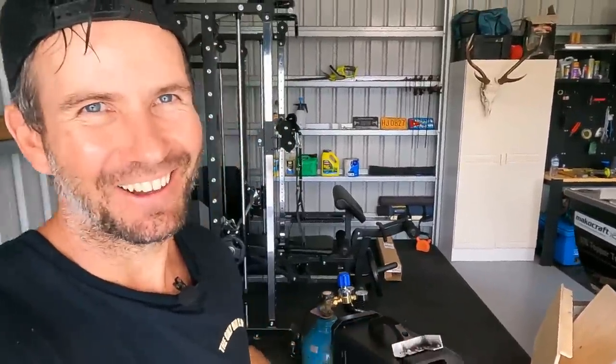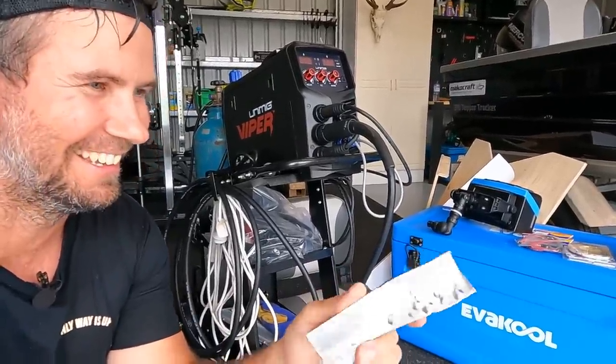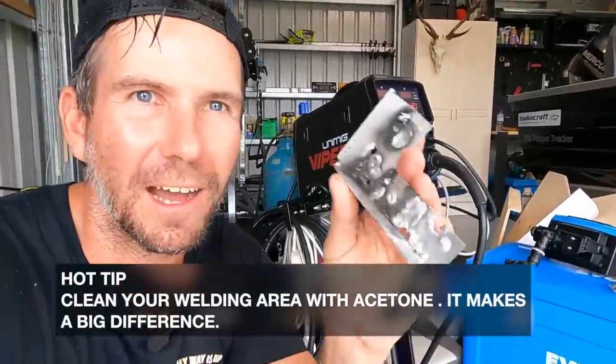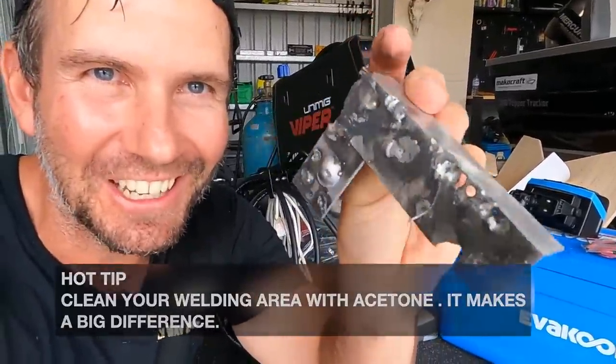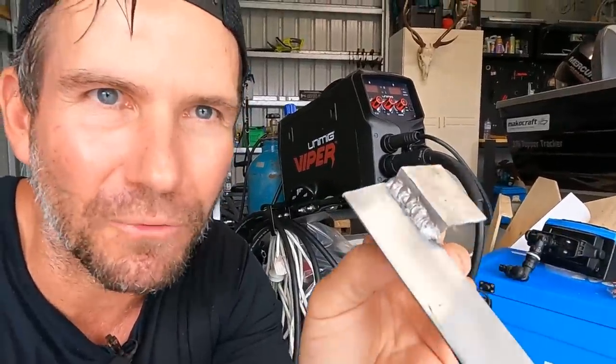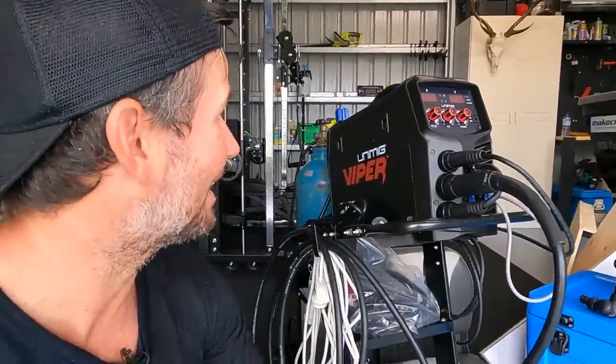Just to give you a bit of background: I'm a diesel fitter by trade, done a lot of welding on bigger gear on steel in the past, but I haven't touched a welder in about seven years and I've never welded aluminium before. This is where we started - there are a lot of things you need to get sorted for an aluminium welder like gas flow, amperage, wire speed, voltage, and you've got to make it really clean. It looks like the seagulls have been flying overhead trying to burn holes in it. And this is where we've ended up - gradually progressing, and there's a nice little fillet on the back. I'm only welding 1.2 mil to 2 mil stuff to make the frames for the tinny. I've pretty much got it dialled in now - don't blame the welder, it's all my fault.